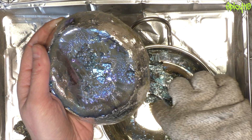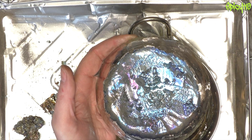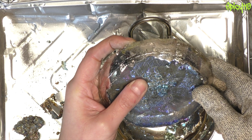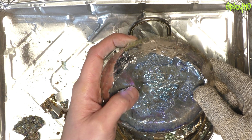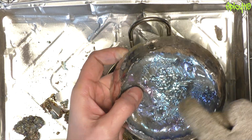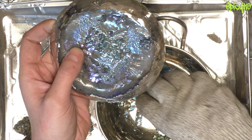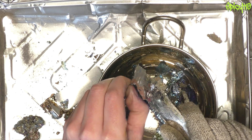The best crystal grew on the very bottom and there's very little going on elsewhere — it all solidified from the top. There's no way of stopping that from happening, so I probably need to do the same thing but keep it covered and turn the heat down. Once it gets a reasonable crust on the top with enough depth for the crystal to keep growing, make a hole, drain it, and do the same thing we've done here. I also have some seed crystals to try and grow some larger bits.